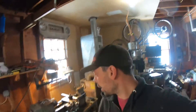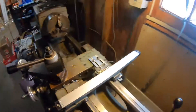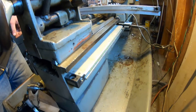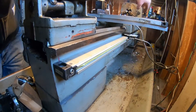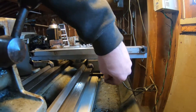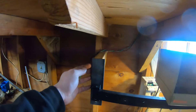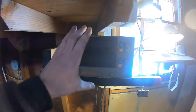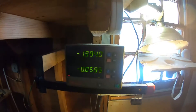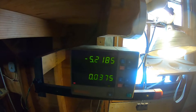Digital readouts are done. The cross slide one is right here, works perfect, came out really nice — we had to use the mill a little bit to get the bracket machined down, but it's in there nice and tight. The carriage slide one went so fast — it's just a couple of quarter-20s drilled and tapped, make sure it sits level, and I had a little piece of steel laying around that was perfect. I mounted the original box on a piece of angle iron on a 2x4 that was already there from some old shelving. You plug it in — it's regular 110 — turn it on, let it boot up, move your slides and you have digital readouts on both axes.